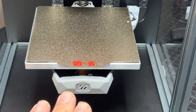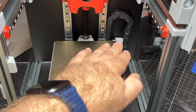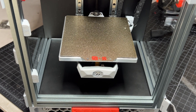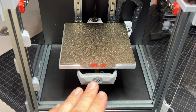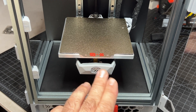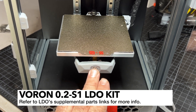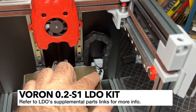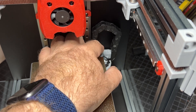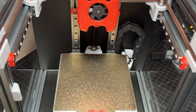Something else: the Kirigami bed is great and I love it, but you do have to be aware that you're going to have to print some different parts that are not stock Voron parts. These are relatively new parts — Christopher Mueller recently posted these. There's even a different part altogether that LDO and Maple Leaf Makers came up with: this is the part for the Stealth Burner LED that's part of the Kirigami bed. From Christopher Mueller there's a spacer you're going to need, a piece that bolts onto the bed, a wire channel, and a piece that holds the nut — so all those pieces are going to be needed.